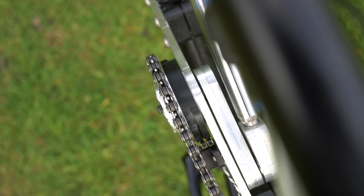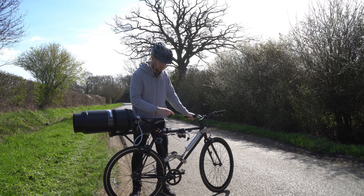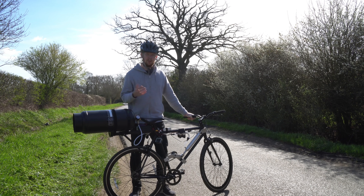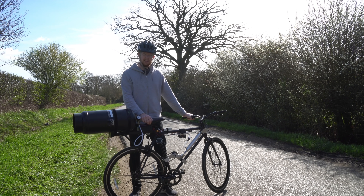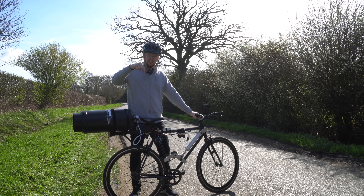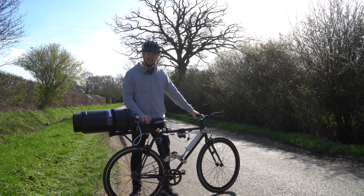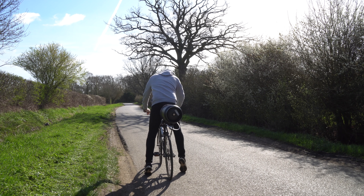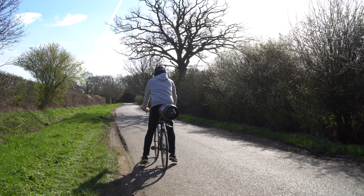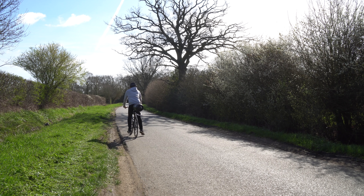I've got the air tank at 100 psi and it's been regulated down to 40 psi for the cylinder. This should give me an exhaust pressure of roughly 15 psi, as close to atmospheric pressure as possible, so I'm hoping this will be a good range test. Leave a comment below on how far you think this bike will go. I don't think it'll be too far but that's what I'm here to test. No pedaling — off to a good start.